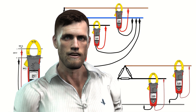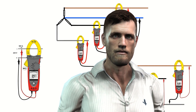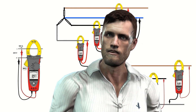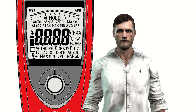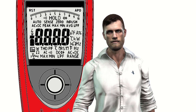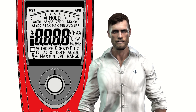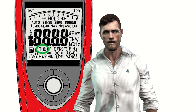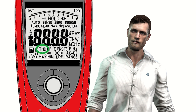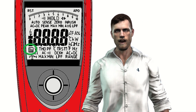In this way we have seen how to use a wattmeter clamp to measure effective power both in single-phase installations and in three-phase installations, in both delta and star configurations. But this Amprobe AC-DC54 Navigator clamp has many more interesting and useful functions. Look at the number of options we can select on the display. It not only allows measuring active power, but also allows measuring the total harmonic distortion — the THD — for both the current and the voltage, as well as the individual percentage values of each harmonic up to the 25th order.